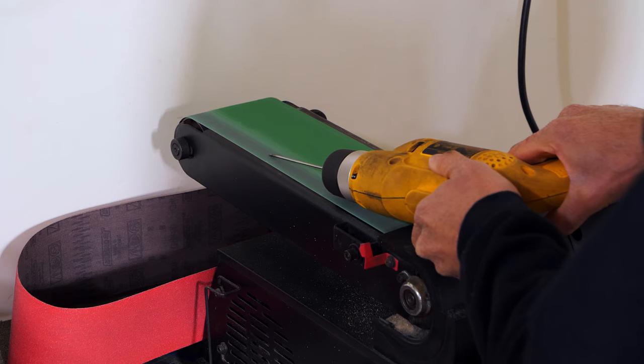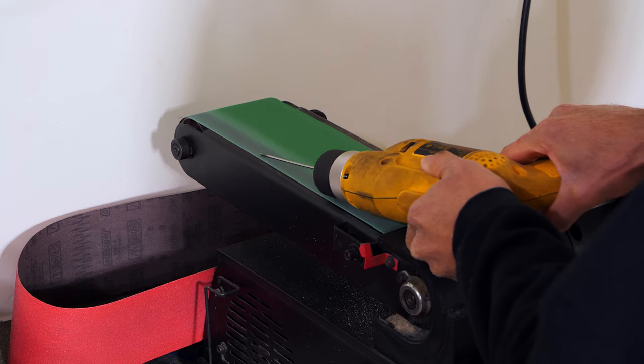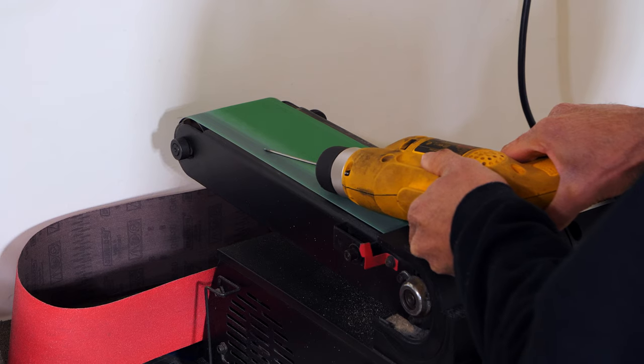There are some people out there that'll say, cut your tungsten into threes and grind them so that you don't have to keep going back to the grinder. But my advice when you're learning TIG is don't cut it into threes. Go to that grinder, because that grinder is going to teach you. It's like a teacher, because every time you mess up and dip your tungsten, you're going to have to go back to the grinder and grind it.